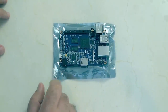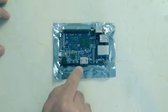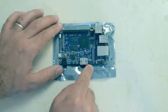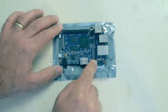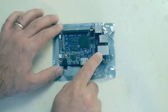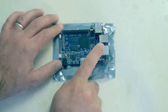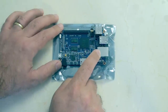Continuing around the corner — there's the power supply connector. This is the HDMI, of course. This is the microphone and the LVDS display connector. This is called a boot button. And here is the debug TTL UART. And the reason that I buy a lot of these BananaPis — this is the Gigabit Ethernet, which is a major upgrade over the Raspberry Pi, and definitely a reason to consider these BananaPi boards.